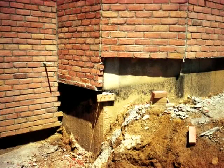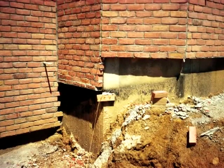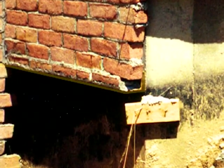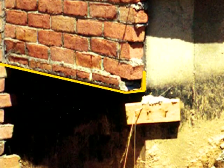The question is, can you lag onto the side of poured concrete walls, as you see in this slide, or a block foundation — can you lag angle irons on and carry the weight of brick and go ahead and veneer the house? Yes, you can. Code allows for you to do that.